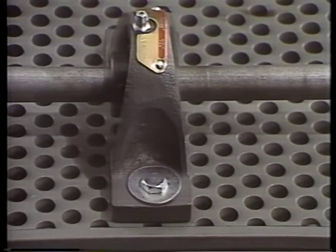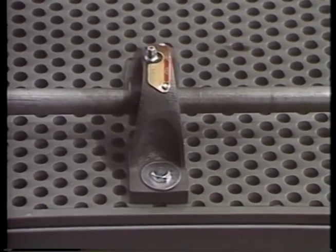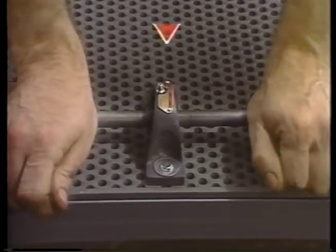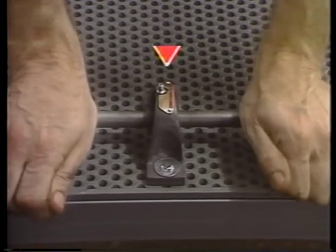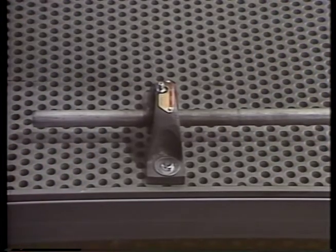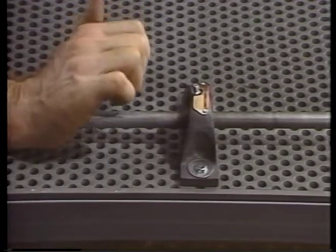First, excessive loads, or loads that the bearing was not intended to bear, will cause early failure. Most bearings are designed to take radial loads. These are forces that are acting at right angles to the shaft. Examples are the weight of a wagon on its axle bearings, or the pull of a belt on a pulley bearing. Many bearings are designed to take thrust loads in addition to radial loads.